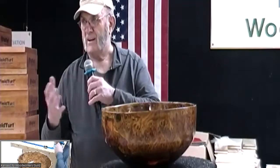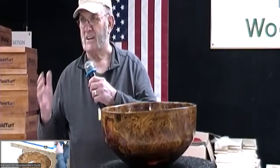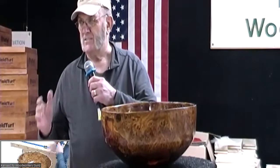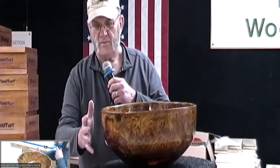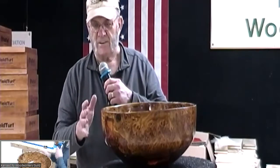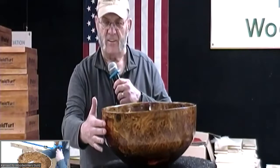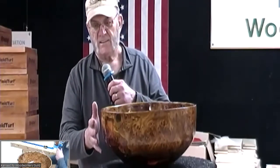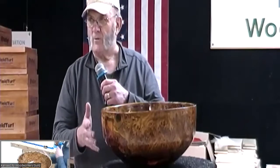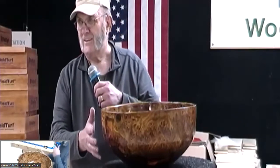I used paper bags, in other words, leaf bags. That's the best paper you can find. It's kraft, it's very tough, and it'll stay together when it's wet. And you can do this in short order. So you create a mold, and the object is to do two things: create a way to fill these voids that are in the wood, and minimize the amount of resin you have to use, because somehow they don't give resin away today.